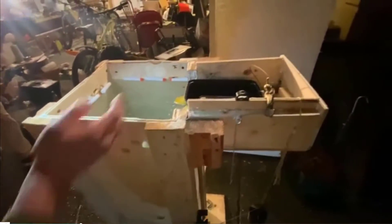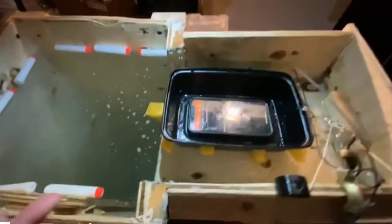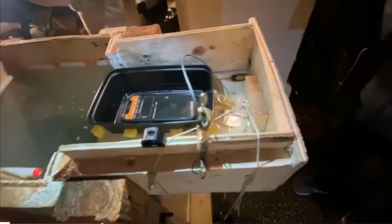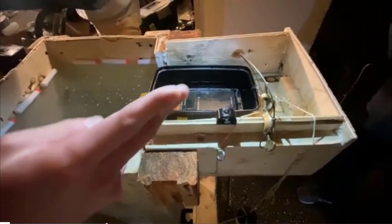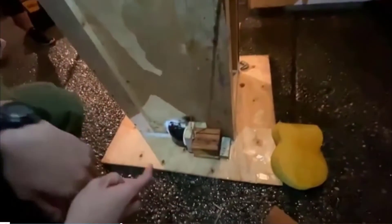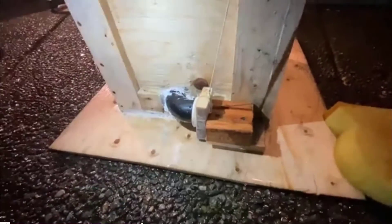So the functional principle: we have the tray, and there are some little foams around the tray that hold the thing to add extra damping. Here we have a metal wire configured as a spring, which gives us a slight force when the string is cut. The string further holds on this weight, which is wrapped around this pulley that I 3D printed myself. This connects to a wooden stopper which holds a rubber stopper into this outlet ABS pipe. This pipe will be released when this wooden piece gets yanked up — the stopper flies out and we have a release of water that drops the water into the main tower.